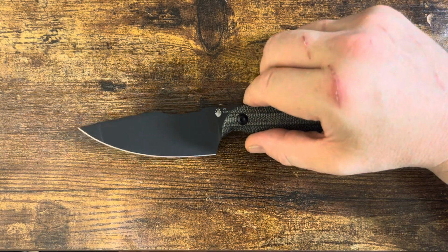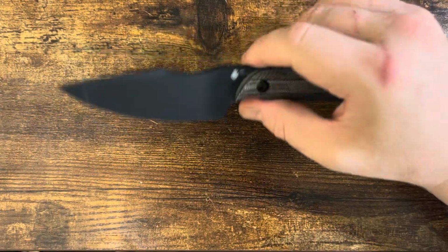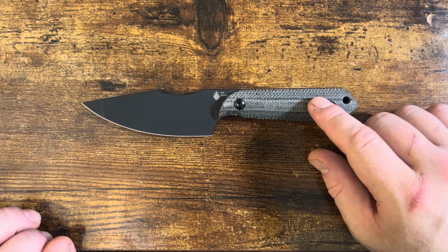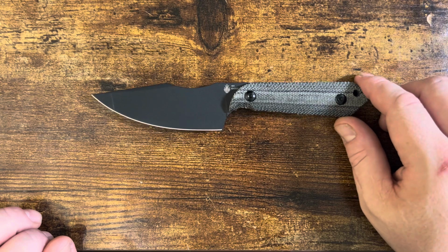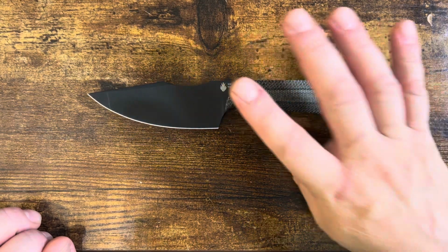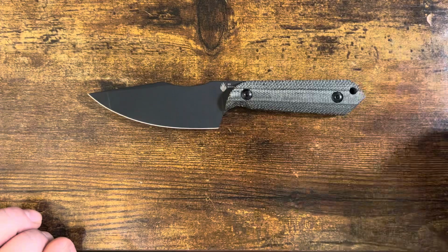It's really a great steel. The worst part is it's non-stainless, but for its toughness, wear resistance and such, this is an oldie but a goodie. The A11 has been around a really long time. 10V is one of the first steels with the high vanadium count. So this has been around a long time, and the particle metallurgy version's superiority to the ingot steel has been known for a very long time. So this is a fantastic knife steel.